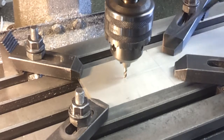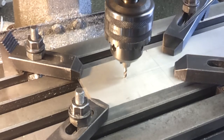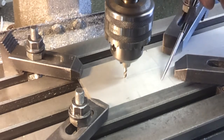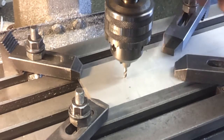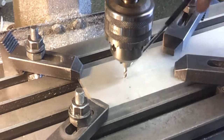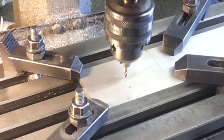I've decided it would be a little easier if I kept the plate in one piece — it just makes clamping a bit easier to handle rather than working on these small plates. So I've marked it up, referenced off the centre, come over to the centre of what's going to be our first plate here, and now we've just got to drill a few holes, pocket that centre slot for the paint scraper, and then come in with a slightly smaller bit to actually make our grommet. We'll start with the holes.